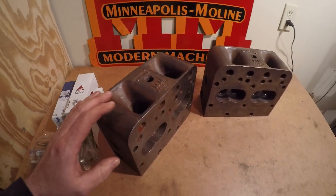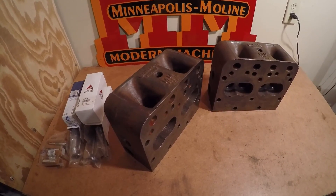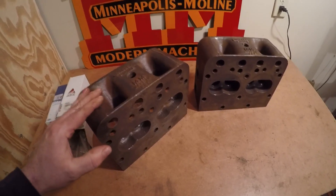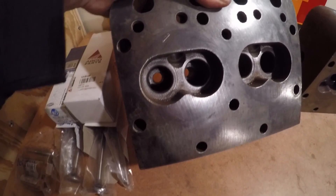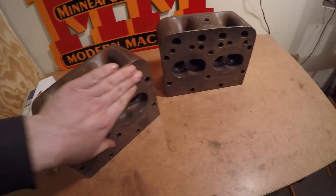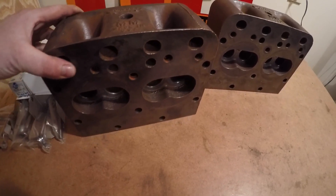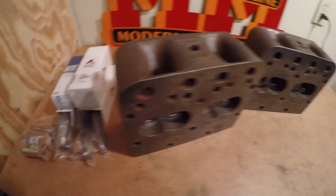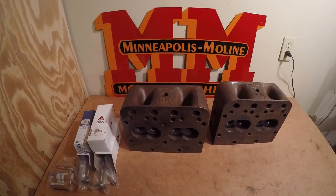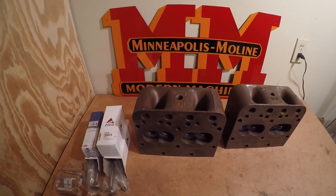Last up we have the cylinder heads. There's nothing special about these — they're standard 10A part number heads. They are not the original ones to X231, but they've been on that tractor since before we had it, so what the original heads were is one of those mysteries of history at this point. The plan is to go ahead and use these — we're sending them to the machine shop. I've already pressed out all the old valve guides, which were getting pretty worn. We'll have the head gasket surfaces planed, then press in new valve guides, refresh all the valve seats, install brand new valves, and get them assembled and ready to go back on the engine. That brings us up to date with everything going on here — keep watching for more videos, and thanks for watching.